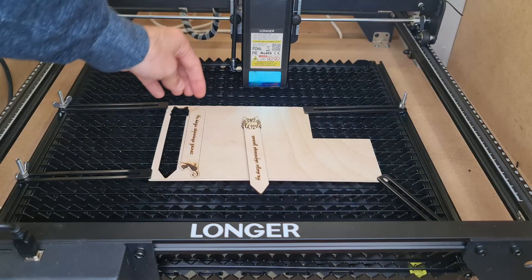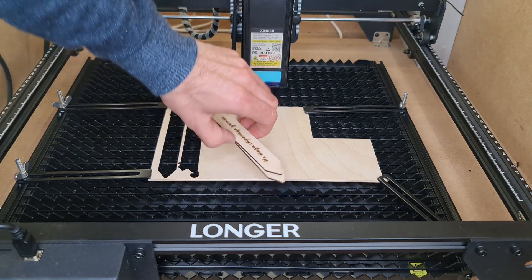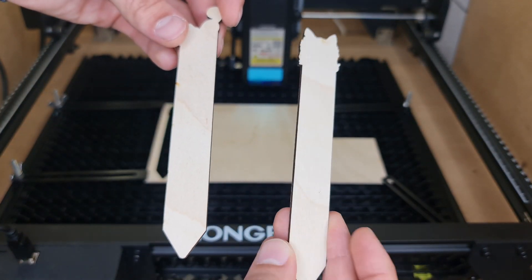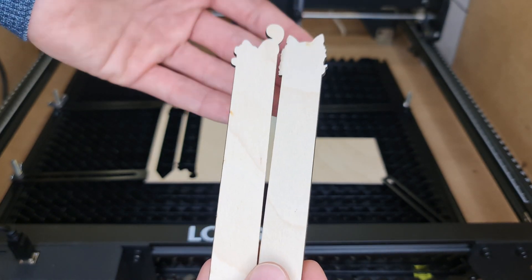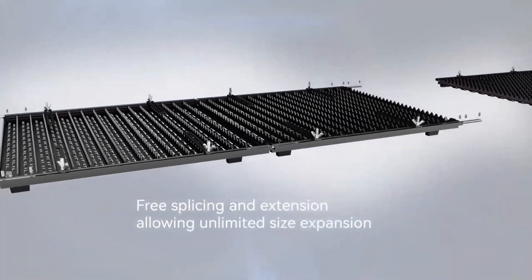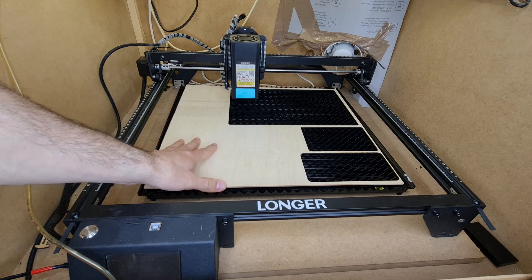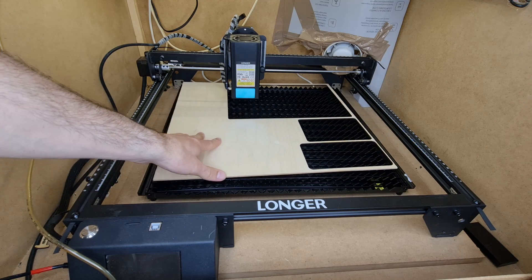Let me now tell you what I like, what I don't like, and what I think should be improved. Starting with the pros: the actual clean result you get out of it works well especially if you do not install the flexible rows, so you have a greater spacing between rows. Then the size, which covers the entire working area of your machine without cropping. The modular design, which allows your bed to grow in case you decide to extend your laser engraver. And the flush design, which saves you a lot of headache so you do not need to cut your material to fit into the cropped area, neither do you get inconsistency if you load longer sheets.